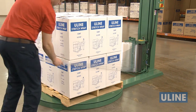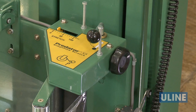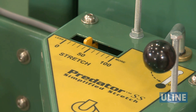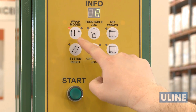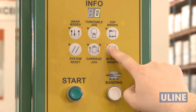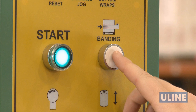Now pull the film and attach to the load on the pallet. Once your film is ready to go, set the film tension to the desired level between 0 and 100, depending on the weight, size and shape of your skid. Now you can select your wrap mode. The wrapping mode button provides the option of having the pallet wrapped in both the upward and downward position for added strength, or just the upward direction. Once you've selected your wrap mode, choose the number of top and bottom wraps and press start to begin wrapping.